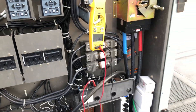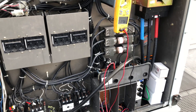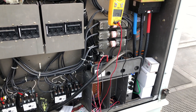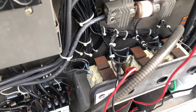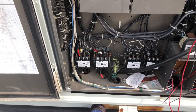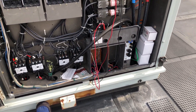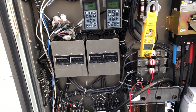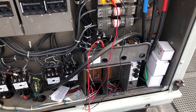At first everything will work fine — your low voltage will be around 26 volts or so, which should be enough to pull in all your contactors and relays. But as time goes on, your output 24-volt side begins to drop lower and lower. As contactors start pulling in, each load added lowers that voltage, and you start getting around 21 to 19 volts. Then you'll start getting chattering, circuit boards not acting right, temperature sensors not reading correctly, thermostats flashing.